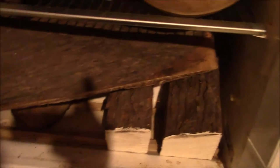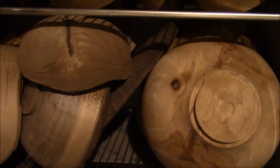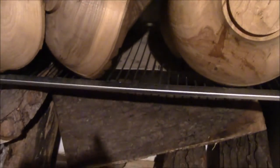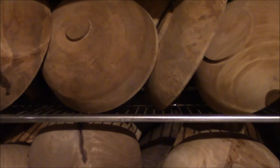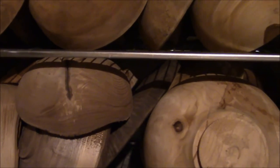I've even got some pieces that will be going through their third drying cycle — for drying square stock. It's still a work in progress. I've run five loads through it, and generally it takes about 10 days, sometimes 11, sometimes a little more or less. It gets me to a place where I have stock fairly quickly. After I take it out, I usually let it rest for at least a week to equalize with the shop environment. I've tried a lot of different drying methods, and this one seems to be working pretty well.